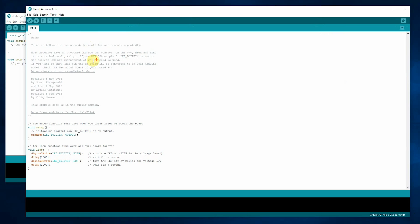For the Edgeboard, the core doesn't yet have an LED built-in, so you need to choose the LED that you want to blink. They're listed on the left-hand edge of the Edgeboard and the numbers you could choose are 46, 37, 44, or 47. I'm going to choose to blink number 44, so I need to change the LED to 44 here, here, and here.